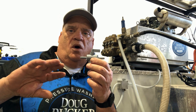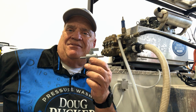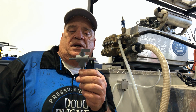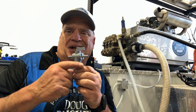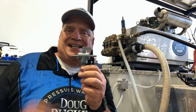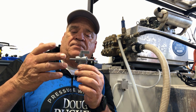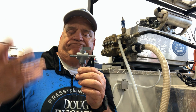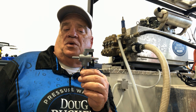Then along came bypass downstream injectors where we could turn a ball valve to stop the bleach flow and also restore the pressure and flow loss caused by having a downstream injector in line. When we mounted these we either zip tied them to something in the truck or trailer, or used a hose clamp to put them onto the hose reel or somewhere easily accessible. A lot of times even with the downstream bypass injector we would hook this up so that we could always rinse the injector out when we were done — that's the key role these play.